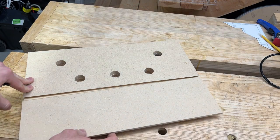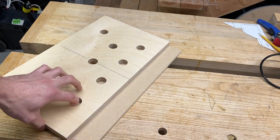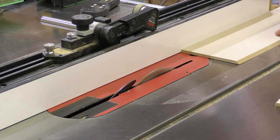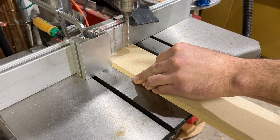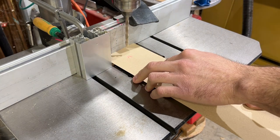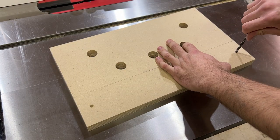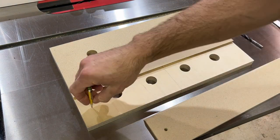Now that the upper piece of MDF is glued to the vertical portion of the jig, we can fit the mating lower section. Mark it and rip down all of the sacrificial inserts to be flush with the bottom of the plywood. Drill two quarter inch holes about an inch in from either end of all of your insert pieces. Using a quarter inch brad point bit, transfer those hole locations to the plywood backer piece, making sure that the two pieces of MDF have a tight seam.